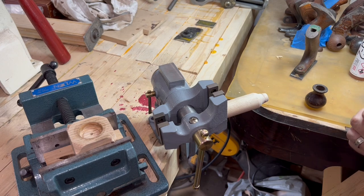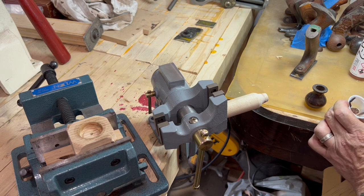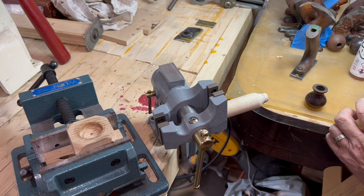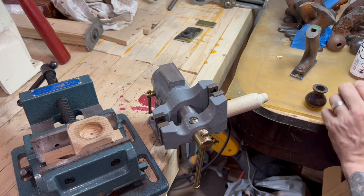For distribution, I just touch it to the side — that's way more than we need. Then I tip my little cup up and bring in a pin drop and mix it up. I can see the Quartersawn color — it's like a maroon. That's really all I wanted was just a pin drop, so I got way too much tint in there, which is a compliment to the folks at Trans Tint. I absolutely love this product — I'll put a link in my video. A nice, rich burgundy color. It's like a deep Quartersawn. Love it.